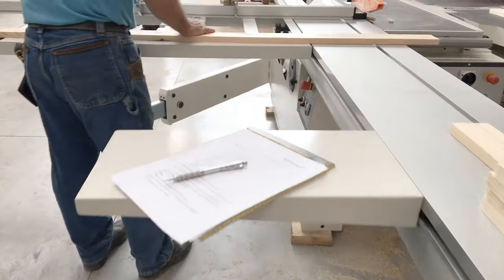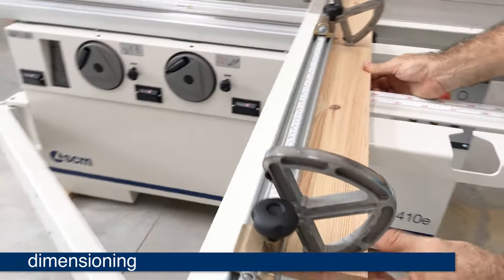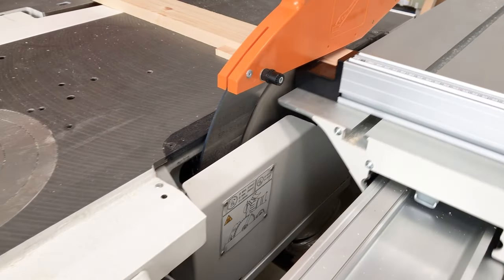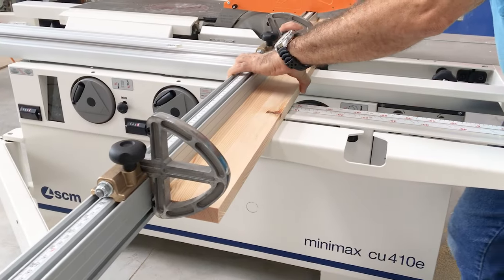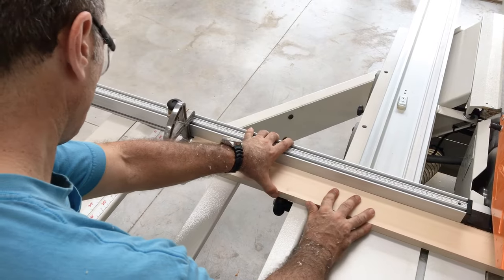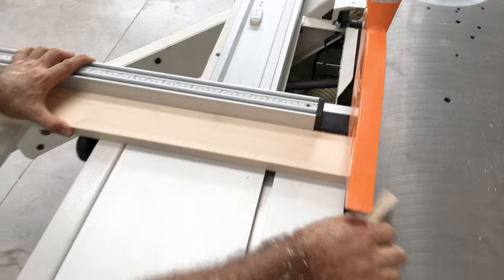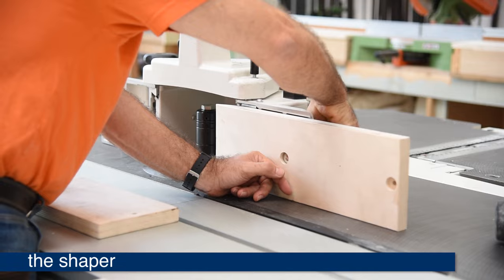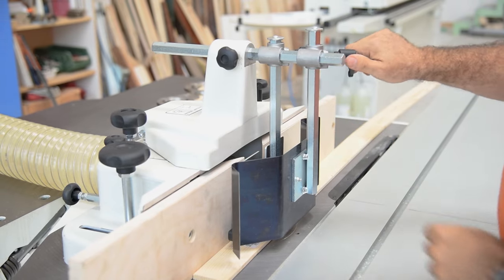We will save that demonstration for another day. Now that we have the widths we want on the remaining parts, we can cross cut them to their intended dimensions, or in the case of our moldings, put them off to the side to be shaped a little later. When it comes to cross cutting, I really prefer to thrust cut — that is, the piece to be cut is between me and the fence, thus I am the clamp keeping things tight to the fence as they are being cut. Next it is time to set up the shaper for the tenons, and all we are really looking to do at this point is round the corner so they'll fit nicely with our mortises to be cut a little later.